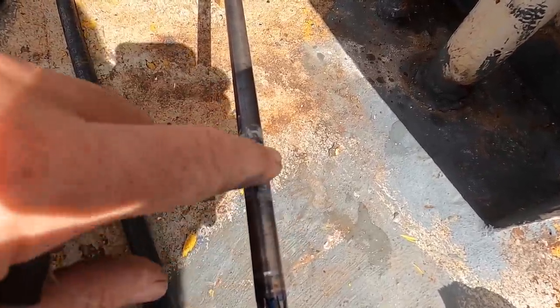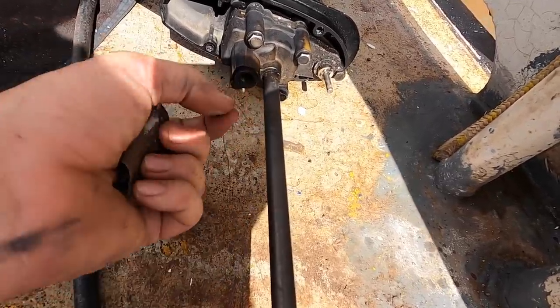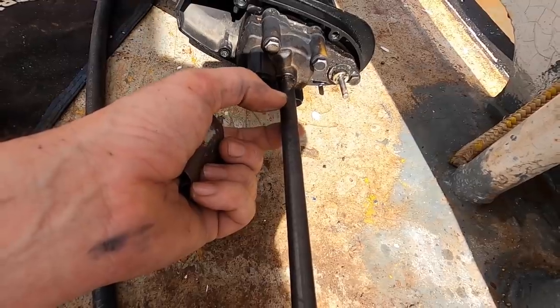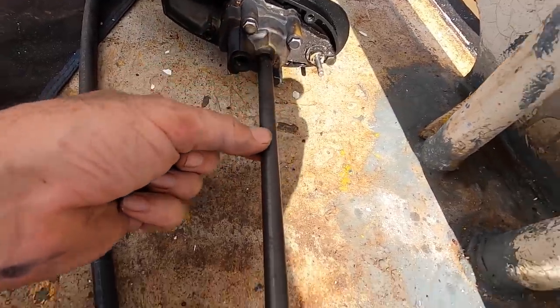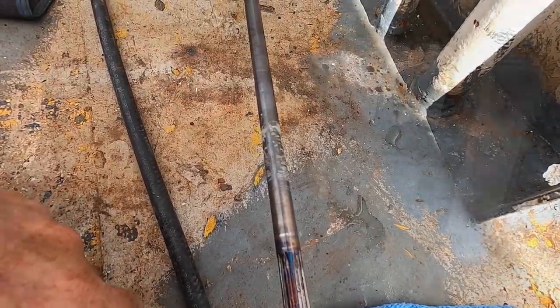Pull the gearbox off and just have a look at the driveshaft. See if you can see old grease like this, or an area where maybe it's even wearing — because as the corrosion grows it swells, and it's really pinching on the driveshaft, so you should see some witness marks too. Just something else to consider in your diagnosis.